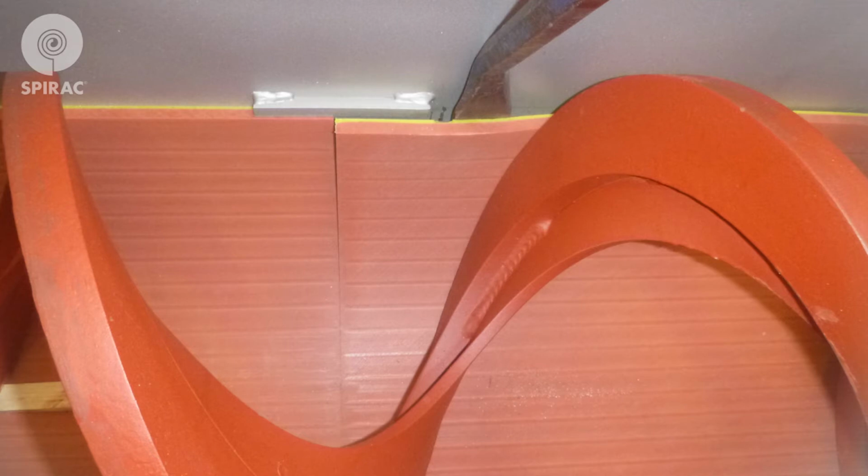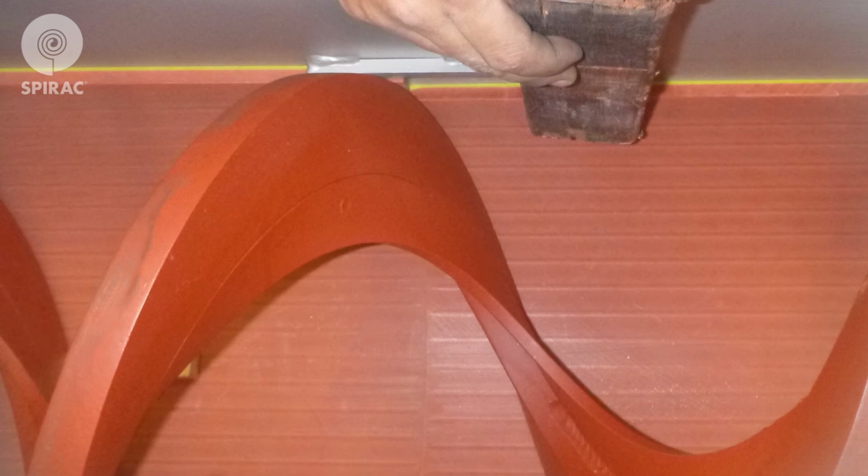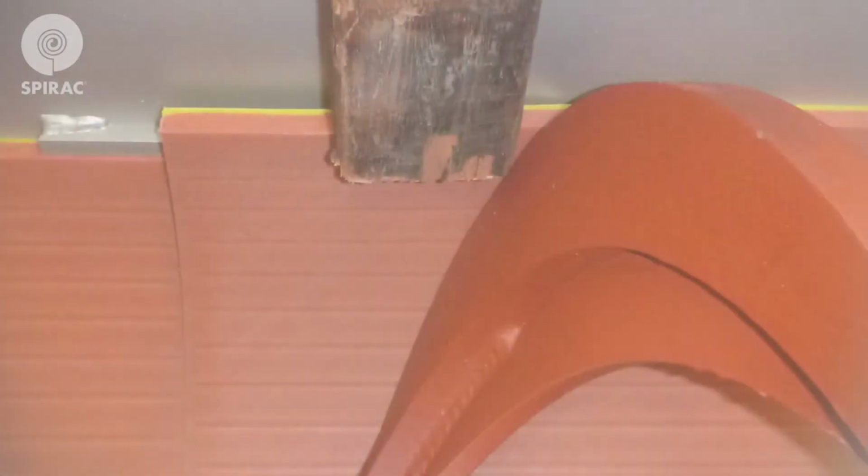To remove the liner, use a pry bar. Place it behind the liner next to a liner cleat and pry out the liner. Pry out the liner until it clears the liner cleats. Use a block and a hammer to drive the liner around the spiral in order to remove the liner from above. A worn liner may require little or no force to remove.